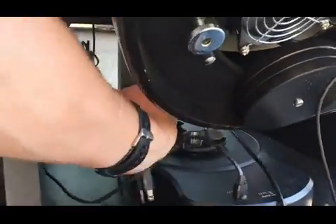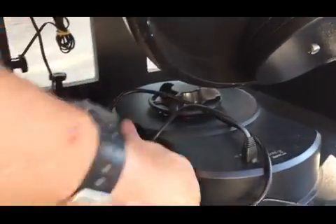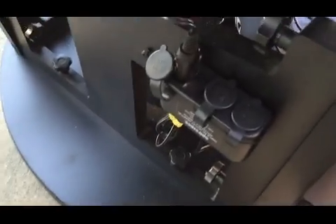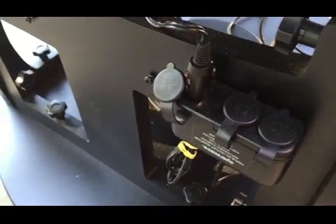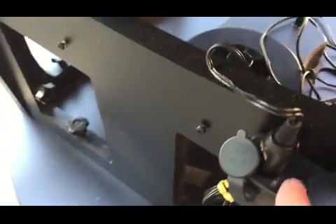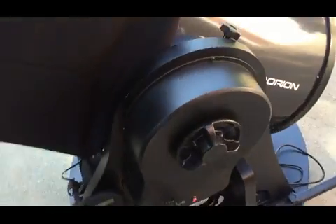I have the standard AC adapter so I can plug into normal home power when I'm near the house and don't have to worry about the battery pack. It goes to a three-way distributor, so I can run the Atik 420 camera, which uses 12-volt DC, as well as my dew zapper system. It also comes with a little red LED light, which I don't like, so I put black electrical tape over it. Because even on shots where I take the cover off due to wind, that red LED will shoot up into the scope and you can actually see it in the pictures.